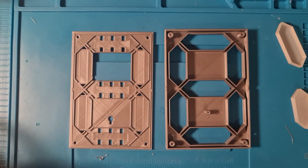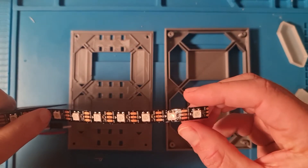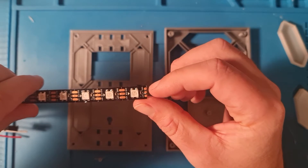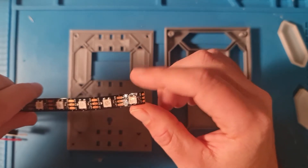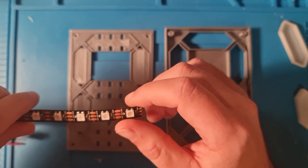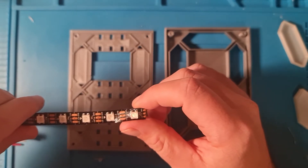I've got these LED strips called WS2812B and as you can see they've got three connectors: your ground, your digital input and output, and your five volts. These can run on 3.3V but it is advised to run at five. In this project I do run it on VBAT which is 3.7V and it works fine.